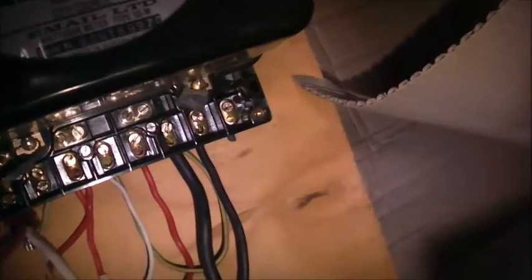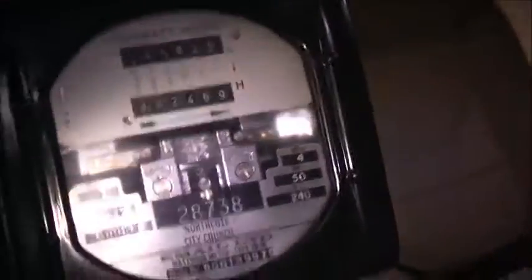So I'm going to drill out this one here, or do as Raymond from 2007 recommended — just pull that wire out and pull the individual copper strands out one by one, and that will loosen itself off. But that's still going to be a challenge to unscrew that broken screw. With a small drill bit and my screw extractor set I should be able to get that — I need a small drill bit, drill a little pilot hole, and get my broken screw extractor set out. That should get it out.